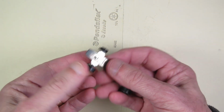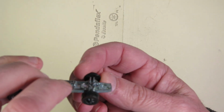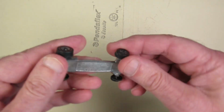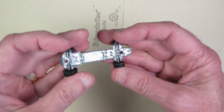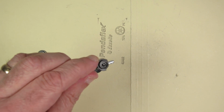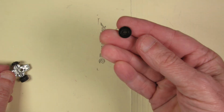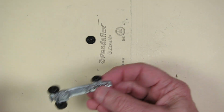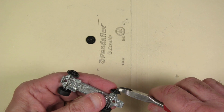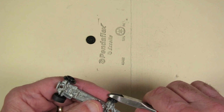As far as the base goes, I just hit that with a buffing wheel, but one of the problems with the casting was a cracked back part of a cap. See it there? Part of that is cracked off. So I've never done this before. Usually I just put new axles on it and wheels, but I have extras of these backing pads, the backing of the cap style wheel, that are good, sitting around from prior castings. So I thought, well, let me just cut the tip off the axle, put that new backing piece on there, and crimp the end. It seemed like there was enough to work with, and as it turns out, there was.